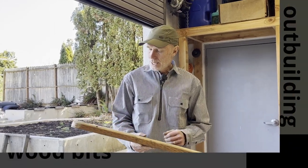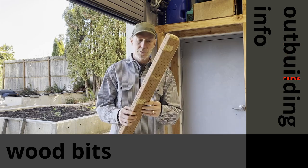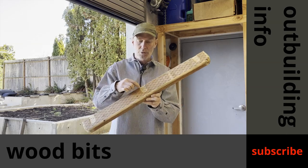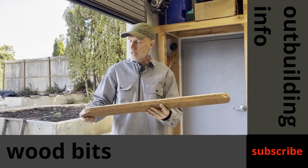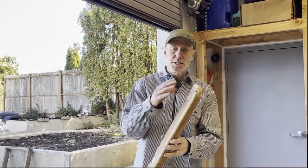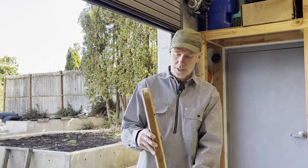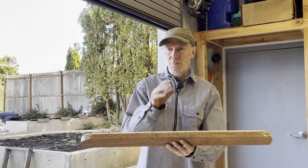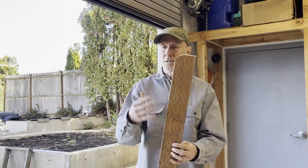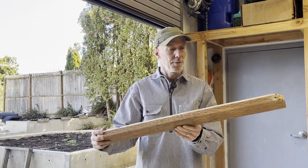The concrete's poured and now I want to go ahead and get ready to put the wood in. And so there's these pressure treated pieces of wood that I cut. I'll cut them down and then I put in a little groove that fits those tabs that are welded on, round over the ends, and then round over the whole side, and then treat the ends. That just helps the ends from rotting out as quickly because they stick directly into the sun and weather. So there's five bays in the fence that we're putting in, so I'll make 10 of these because one goes on each side and then the cedar screws into these. You'll see I've got jigs for these and they go together pretty quickly and I'll knock these out.